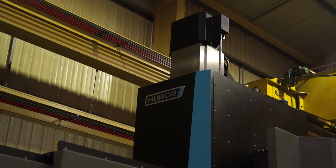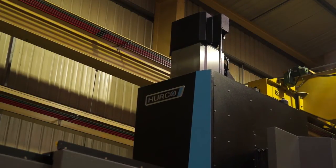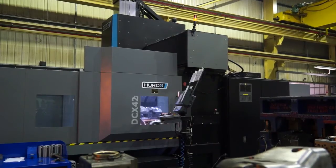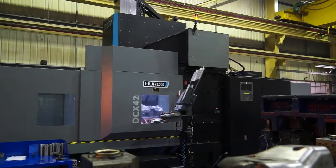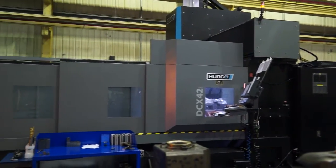If you're looking to buy a machine like this and put large components on the table, this model has lubricated slideways in the Z. You can see the large box column structure to keep the head rigid. On the X and Y axis we use roller bearing trucks, four per axis. And it's a very big, bulky machine, so you've got things like 80mm ball screws.